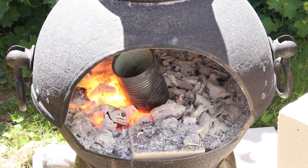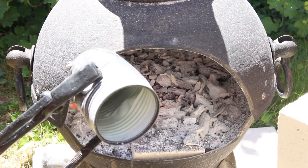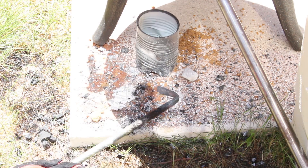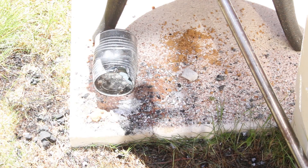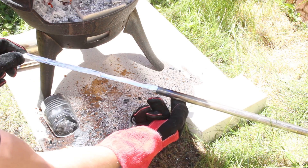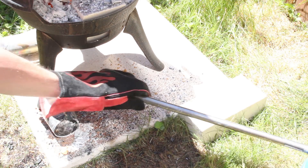So I'm going to see how that's done. Oh yeah, look at that - it's melted almost completely into the bottom of the tin. I don't think I can pour it just yet. Oh actually, there's a hole - the tin's got a hole in. The aluminium's molten. Look, molten metal! But the tin's got a hole in - it's burnt through and all the aluminium's come out in my fire. I probably need a better crucible than that. So I found the rest of the aluminium - it actually melted and it's run down inside my blower tube. Ta-da, my first aluminium cast! Just as well I stopped it, otherwise it would carry on running down and probably melted my pump.